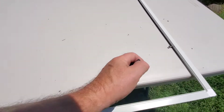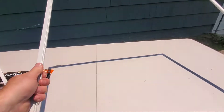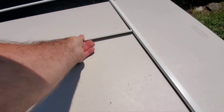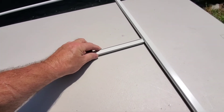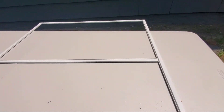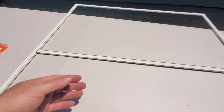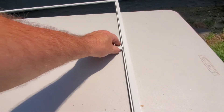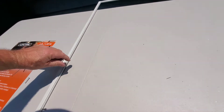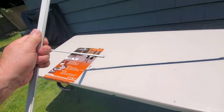We've got springs at the top. I'd like to put a cross member in the center because when I put the screen nice and tight it'll have a tendency to bow without that — the ends bow in like bananas. So you have to very carefully put the screen in with little to no tension.